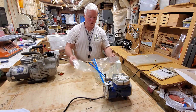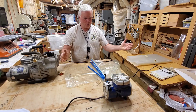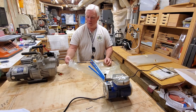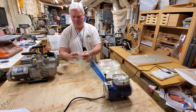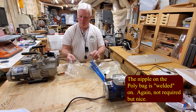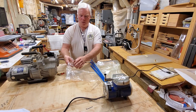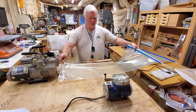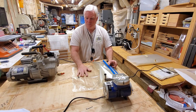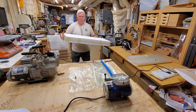The problem with a vinyl bag — there are pros and cons. The pros are that it's cheap and easy to build your own custom length. The cons are they're not anywhere near as durable and pliable as the polyurethane bag. Also, the valve you screw in — even with a rubber seal on the bottom — after about 10 or 12 uses, it would be difficult to achieve a good seal. I would have to slice the bag off and move the nipple back. Also, the thin vinyl bags are not as forgiving when they get poked by a piece of fiberglass.